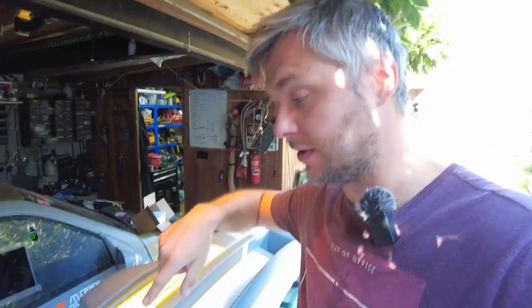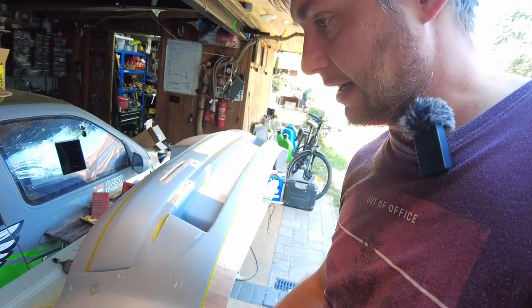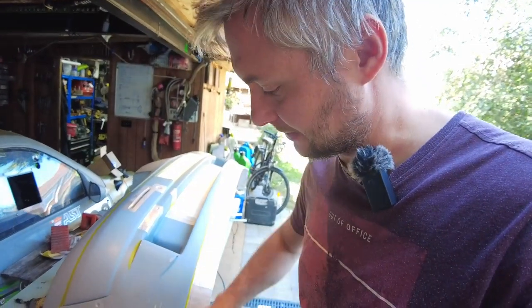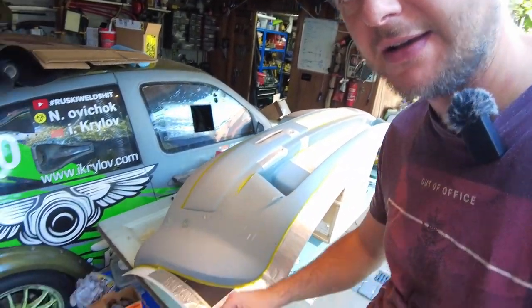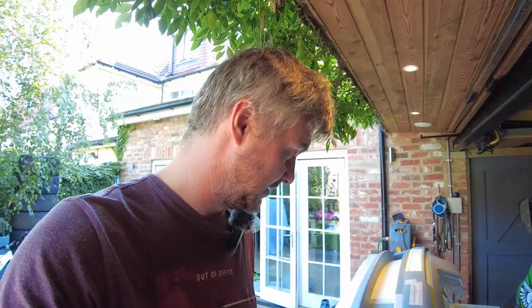Also, we obviously filled the main gaps. They will be cut out at the end. And then here, because I actually have my kick plate or whatever you want to call it to cover the tires, basically where the front splitter goes, that's going to be molded into the bumper itself. So it actually almost acts as a flange. Once we cut it here, that will be one seamless shape from the bumper, so we don't need to put any extra bits on it, saving weight. This is still, well, deboned, but I mean, they're small pieces, but that's another 50 grams we don't need.